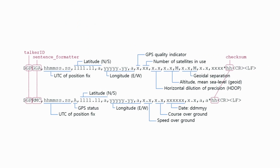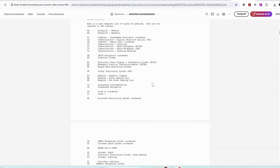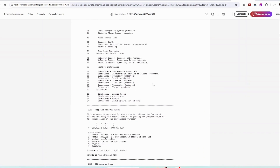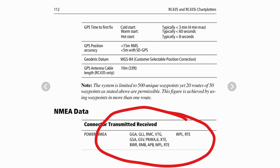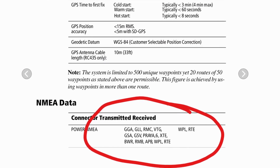RS232 was a very popular protocol in desktop computers 20 years ago for connecting modems with the first ones we connected to the internet with their little beeps, or even mice, and used the famous DB9 connector. At a logical level, NMEA 0183 is a very simple ASCII protocol based on 8-bit characters that encode different sentences with the information to be transmitted. The list of sentences is already public and has been expanded with the arrival of new features such as AIS over the years. Plotters and NMEA 0183 devices usually publish in their manuals the set of input and output sentences they support.